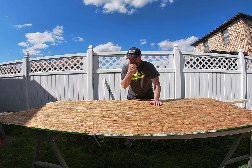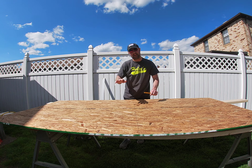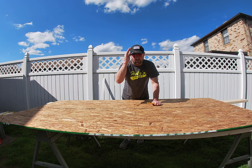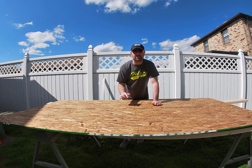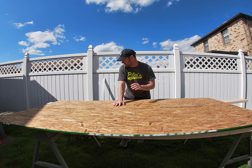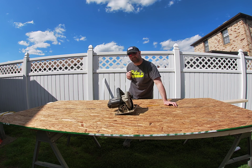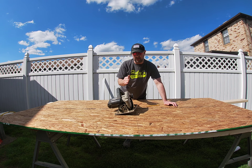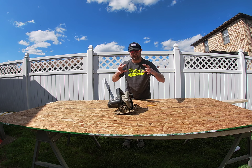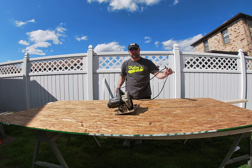I want to get a nice dark line, and before I cut anything — you know what they always say: measure twice, cut once. So I'm going to check myself one more time before I make this cut. Good to go. Now I'm going to get everything off of this because I don't want something falling off when I'm making the cut. Listen — anytime you're cutting any type of sheet goods, inside or outside, make sure you have glasses on. These are safety glasses — you can pick these up at Lowe's. They'll protect your eyes and you'll look cool wearing them.